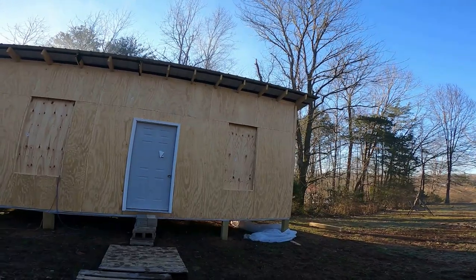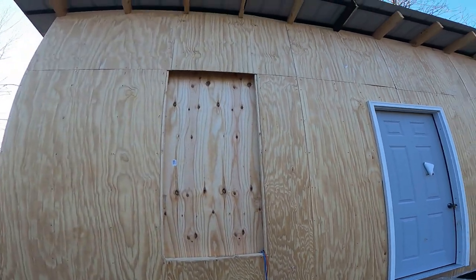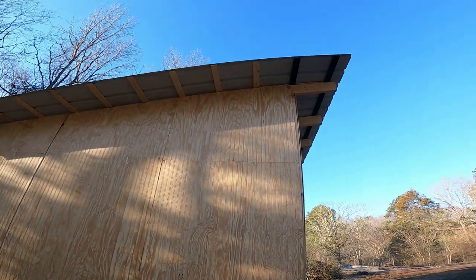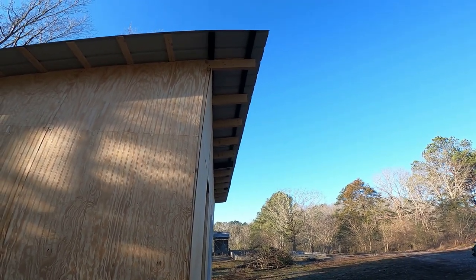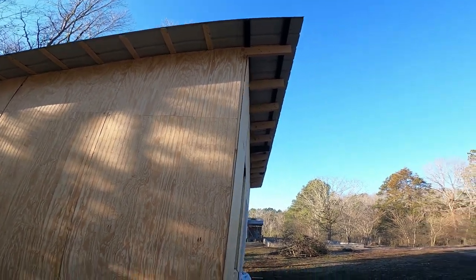I haven't put the trim on the cabin yet because I'm going to roll most of this out — I can roll it a lot faster without the trim up. I still have some stickers to take off. I want to get this done today so I don't have to worry about the rain — this oil is going to seal it from the water. Up at the top you can see the rafters and purlins that I still haven't touched. I'll brush all that in, and if it gets too thick I'll wipe it off. Near the top of the wall where the paneling is, I'll have to brush that down since the roller won't reach without hitting the tin.